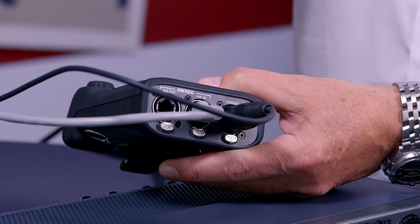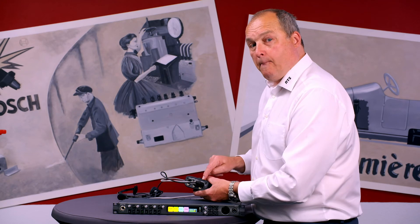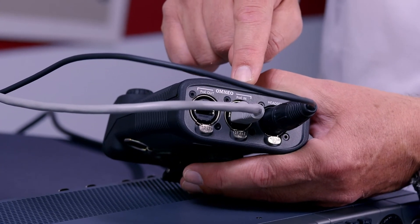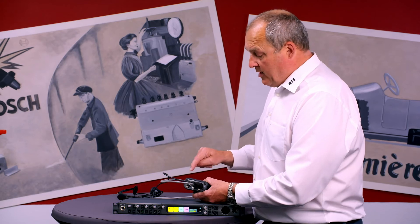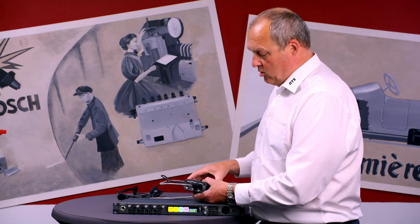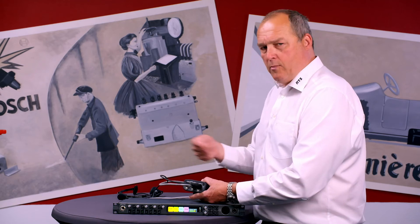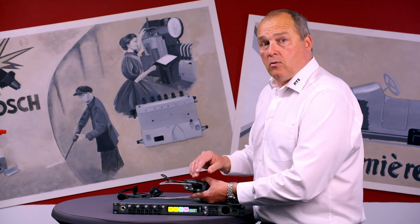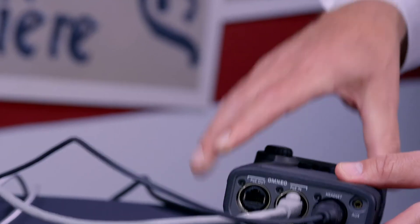The bottom is equipped with an XLR for the headset — a five-pin or four-pin headset connector. The four-pin and five-pin are available as a female connector in RTS mode, and the four-pin as a male connector for Audiocom and Radiocom mode. In the middle there is the Power over Ethernet connector. You can also daisy-chain up to six belt packs together — connecting five additional belt packs to this one. It is not rapid spanning tree, so you cannot create a loop, but it's perfect for positions where you already have a cable run and need an extra belt pack without running cable all the way back to the switch. Imagine a cameraman and camera train operator sharing one cable with two belt packs.